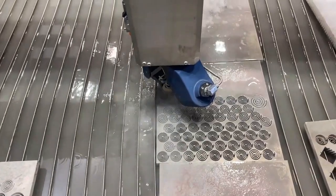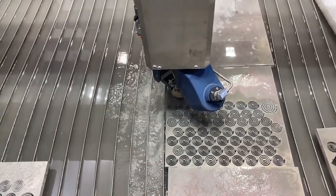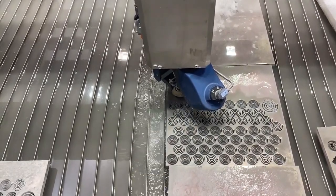Okay. And now you said this one, I was thinking 3-axis, but this is a full 5-axis head. Yes, this is a full 5-axis head, which can cut up to 60 degrees left and right, with infinite rotation, integrated abrasive supply. So it's our latest development of the 5-axis head, which we have had for many years, of course. So tying in with that 5-axis and the plus or minus 60 degrees, how accurate will this go, and what sort of depth of cut?